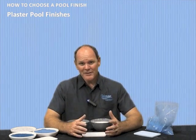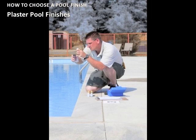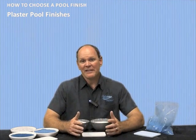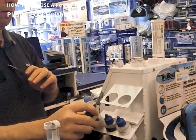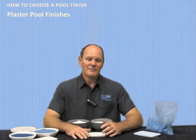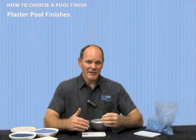And I also mentioned that all pool finishes are going to require a certain level of care and maintenance, and you know that's an open-ended statement. And what does that mean? I define it as such, just your baseline simple maintenance is that you brush your pool once or twice a week. You check the pH and the alkalinity at least once a week, twice in the summer, that you get your calcium hardness and your cyanuric or your stabilizer, they mean the same thing, checked every couple months, and you try to keep the chlorine around 1 to 2. And with the plaster finish, depending on which form you take, and we'll get into that later, that level of maintenance can be increased, just to maintain the overall appearance of the plaster finish.